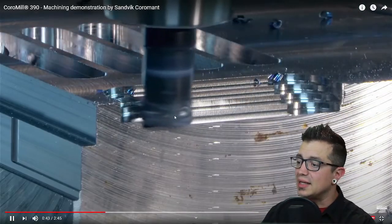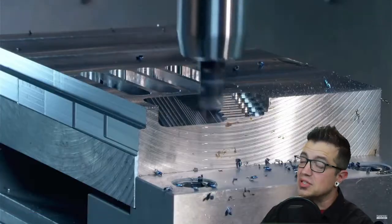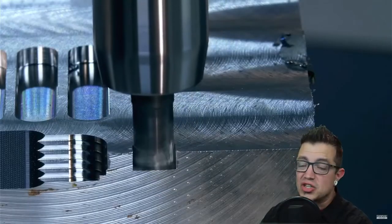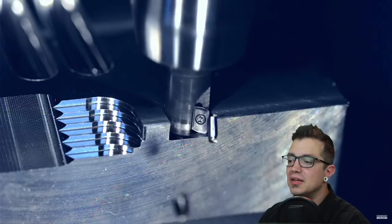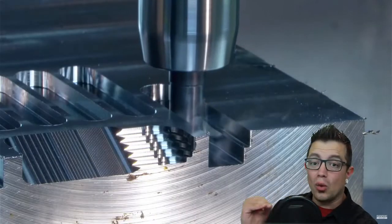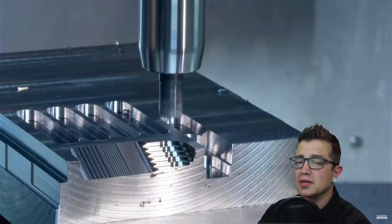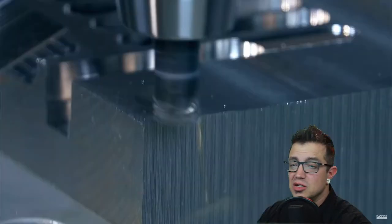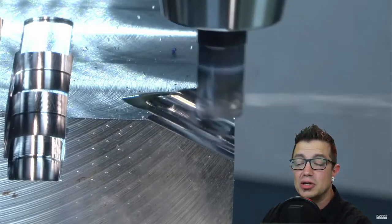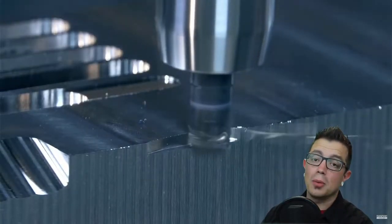You can get a variety of corner radiuses, you can get a variety of grades for different materials. And having a one-inch, a half-inch, a three-eighths gives you a lot of flexibility and versatility for that go-to tool that's always set up. All you need to do is swap a set of inserts. So now you've got one body you can rely on, while having a variety of inserts which allow you to quickly adapt to the variety of materials you're going to see in a job shop environment.